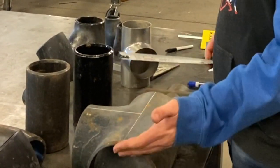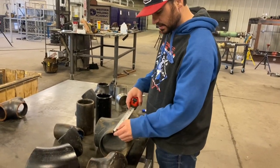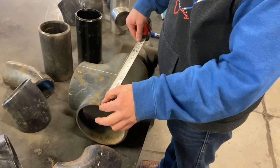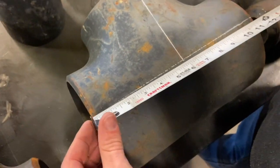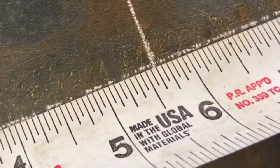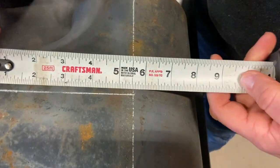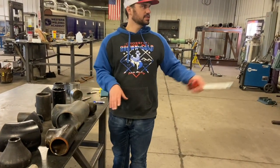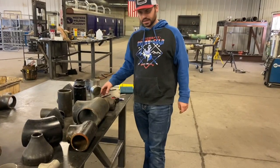This is a six inch standard T — six inches, six inches, six inches. All the openings are the same; it's a standard T. You measure this and it's 11 and a quarter. So half of that would be five and five-eighths — half of the T. From this center line to the end would be five and five-eighths. When you measure from this face to the center line, you're also going to be five and five-eighths. There again, six inch standard T, just the same as a four inch standard T — they're always going to equal the same dimensions.